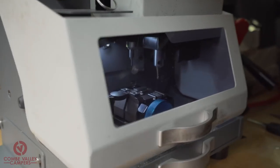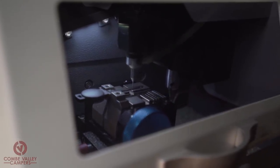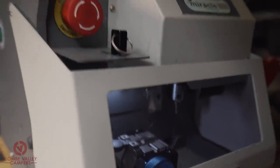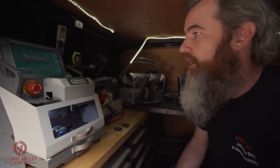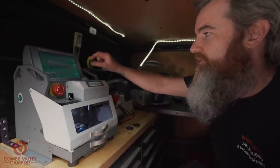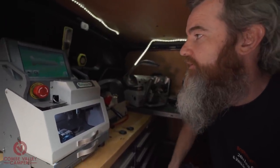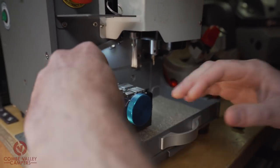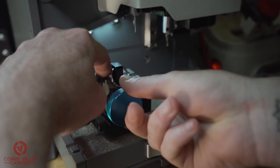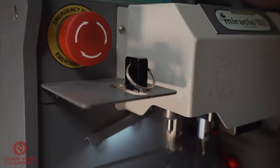Hopefully we'll get some good cuts — so it's going to scan it first and then replicate it once you put a blank in. What that's given us is a series of numbers. The ones in red are not quite the same depth — it's flagged them red because that's the nearest height number to how it's been decoded. I think that's probably right, so we'll cut a key and see what happens. We put our key blank in the same position and tighten it up on the jaw. In a few seconds that key will be cut.